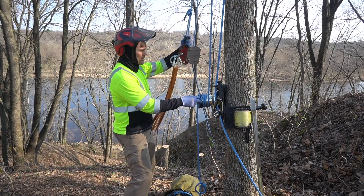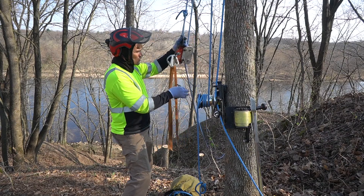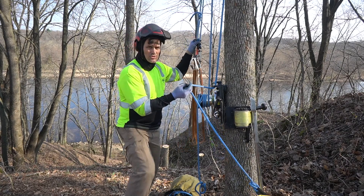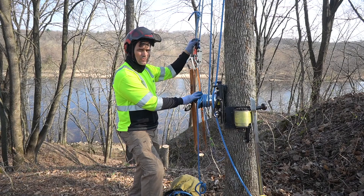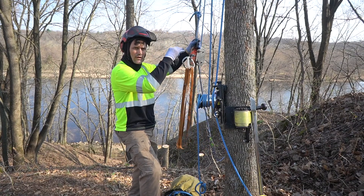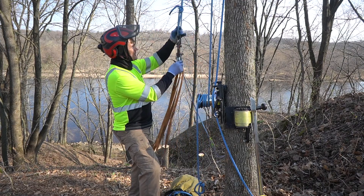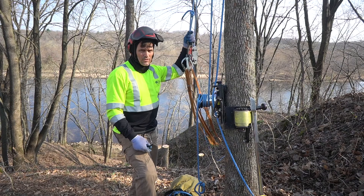We've got the tagline, which right now is tied off so it hangs here for us. Ordinarily we'll pull the actual speed line, tension that on the tool — we've got a drill that we can put in here to speed up those revolutions — tension up that line and lift the load off the ground.